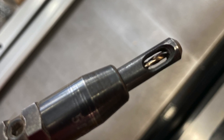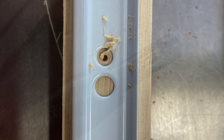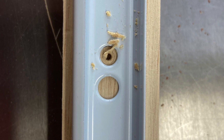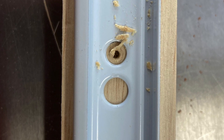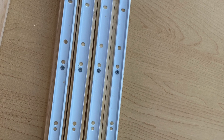This is a centering bit. It's extremely helpful when you're trying to drill holes right in the center — that's where you want your screw to go. With a beveled top, if you're a little bit off-center, it will pull your slide out of alignment and give you a headache. So get a centering bit and solve your problem.